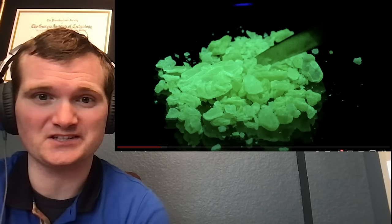The dish from before was already in the furnace, and he started loading it up with spoonfuls of the uranium glass mix. He waited for it all to melt, added some more, and left it there for about half an hour. As a safety precaution, this was all being done in a fume hood just in case it let off any uranium fumes. In reality there probably wasn't much, but it was obviously something to be very careful with. When it looked ready, he preheated the graphite block again, took out the dish, and poured out what was hopefully uranium glass. While still red hot it was hard to tell, but as it cooled it was definitely colored this time — a really nice and bright yellow.